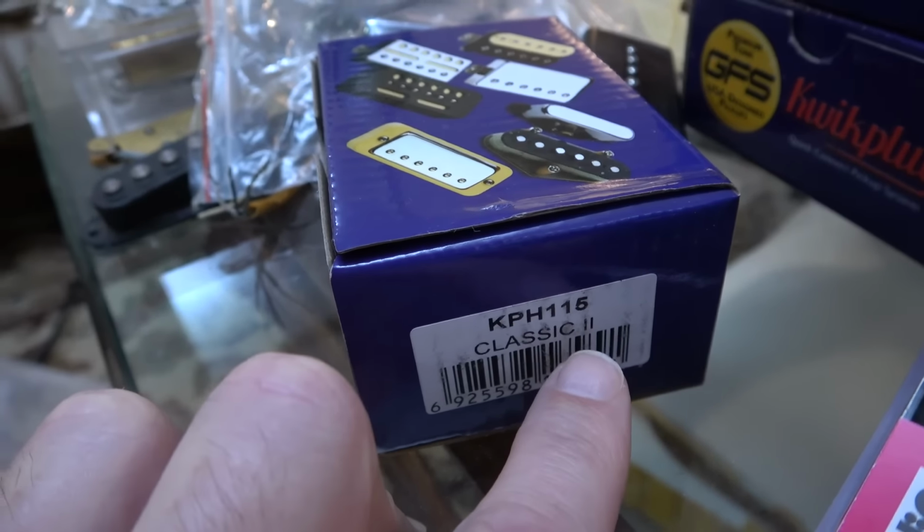Yeah, you see all the dimples that I made there? It's looking to me like a 1/8 should work. A little bit wide. I probably could get away with something slightly smaller. Let me see if I can get away with something smaller first. Like I said, always err on the side of smaller. Yeah, 7/64 is actually going to get it, isn't it? That'll get it. I'm going to tape it.